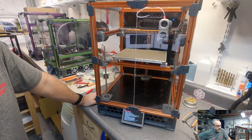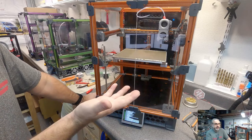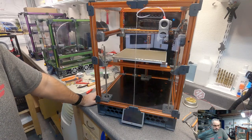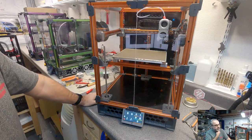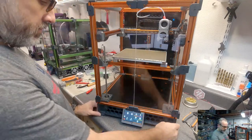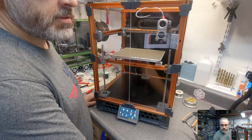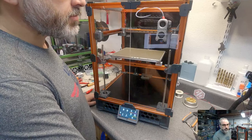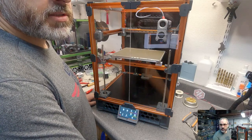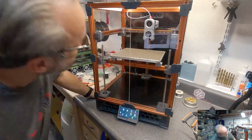And really, I don't know that there are any real quantifiable things that we could do to see how this is going to work long term on a stream, other than this is how it gets installed, and then we'll confirm. I think we lose 15 millimeters or so of Z travel. I need to reset my Z end stop position. Yeah, and I need to do that before we can get an accurate Z travel. Let's see, where are we at? Reconnect. Let's turn those lights on, because we can. I plugged in my Z end stop, yep.